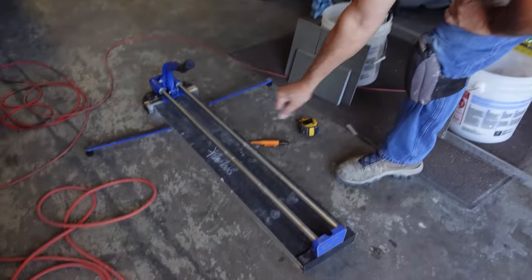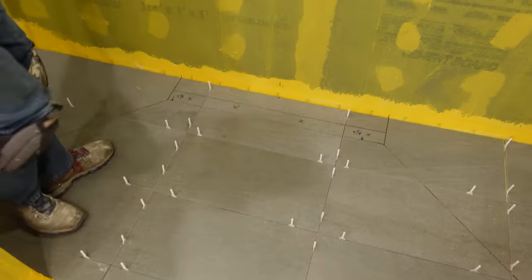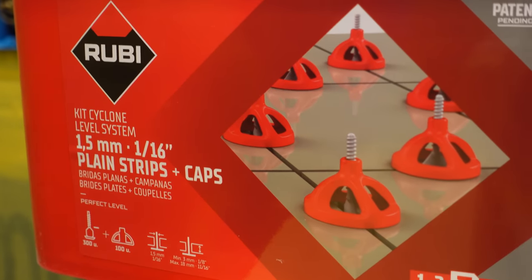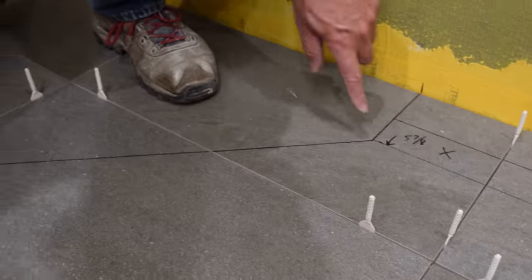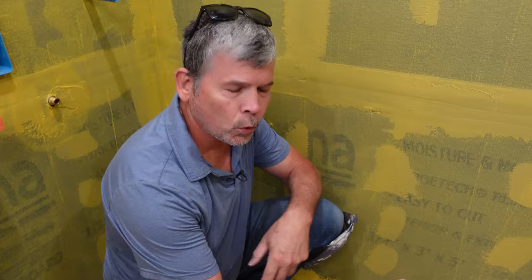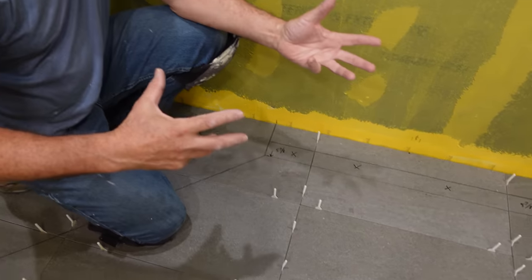The other half of the kit is a snap cutter. Envelope cuts aren't a beginner thing, but if Jordan and I can do it, so can you. We cut and fit every tile using 1/16 spacers. We're using this Ruby brand with the screw-down clip — a first time for us instead of wedges. We had the whole shower laid out, transferred the drain location for our linear drain, then connected the corner of the drain to the corner of the shower where the valley is in our pre-slope. We already tested water flow and it runs right toward the drain.